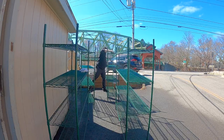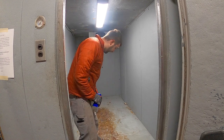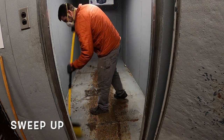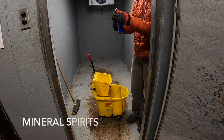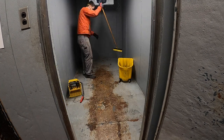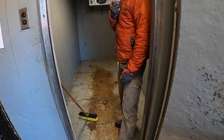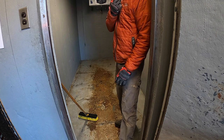Anton's over here cleaning the shelves. Something to note: you really want to put the stripper on liberally. I'm seeing that it's not coming up fast enough — there are a couple spots that are bubbling, but we've got to get this on a little thicker. This is about four ounces per gallon, so I'm going to do about half of this in a bucket of hot water. Try to add some ventilation — I have a door open behind us to help circulate air through. You might want to do small areas at a time because having a lot of this down is a little bit of a fire risk.